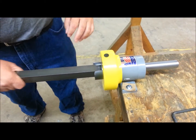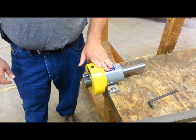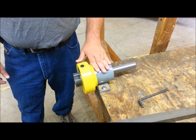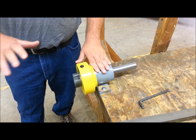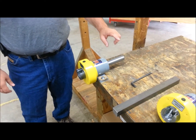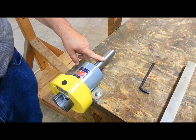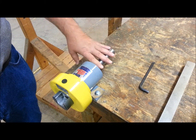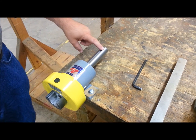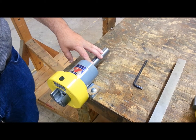The safety chuck is available in different duty ratings. This is our standard duty safety chuck. It will handle roll weights up to a thousand pounds — it's our lightest duty unit. The shaft extension on the drive model is inch and a quarter. You can hook up a brake or a drive unit to this shaft. It comes with a keyway, and different shaft sizes are available if necessary.